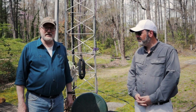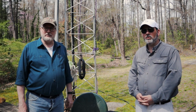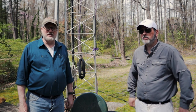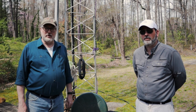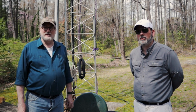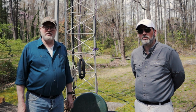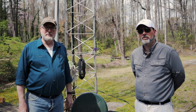And what's nice about this antenna, it has low SWR on 40, 20, 17, 12, and at least the upper half of 10 meters. And it's easily matched on the lower half of 10 meters, 15 meters, 30 meters, and even 60 meters. And sometimes, depending on the installation, you may find that you have a region of low SWR on the bottom of the 80 meter band.